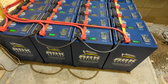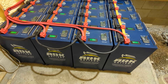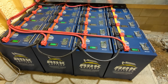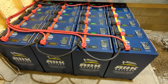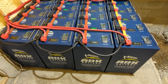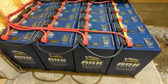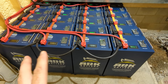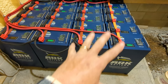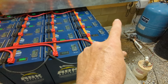We've been using these batteries for four years and they have been flawless — we love them. The improved battery with closed-loop communication is a stackable battery, taking some of the features of this battery: the same balancing, the same BMS, the same cells, but going to a different form factor with casters and stackable without a rack. It's kind of like a Home Grid but without the extra relays and controllers, and still having casters to move it around. I could put a Giga Stack in parallel with this because it's the same chemistry, same battery, same BMS, but with closed-loop communication controls through the Giga Stack.